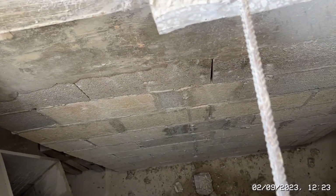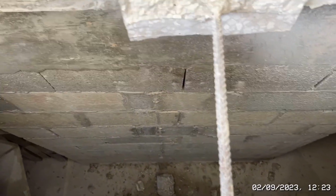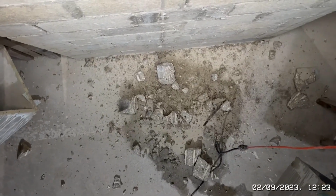Which means all of that, if you watch probably video 70, 75, this floor was out in the open for quite some time, so I literally had the whole thing Ospho'd. It took ages, it cost a lot of money, but it was well worth it. So it was just literally turning any of the orange in the steel completely black, so that when we poured the concrete, we had a limited chance of it blowing. My apprentice has got a bit of a job to do down there.